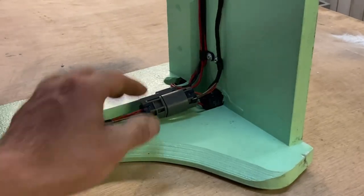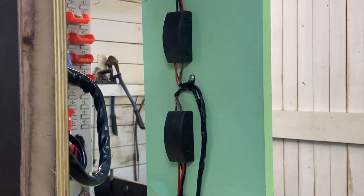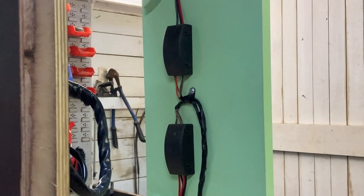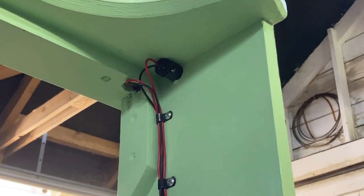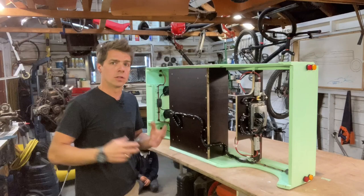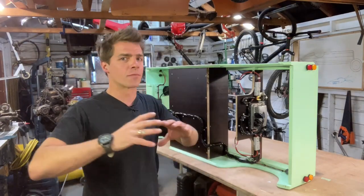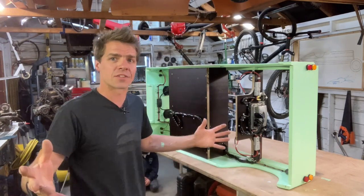The rear lighting system is far simpler. Everything comes from the loom via this plug, which feeds round onto the rear panel and separates into left and right hand circuits, each of which then goes into another junction box where it is separated again to feed the indicators and side lights. All of which means I'm basically now ready to attach the body onto the frame, which is a moment I've been waiting for forever. After that, there's just a couple of little finishing touches to do and it's finished.